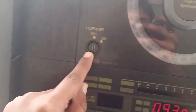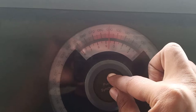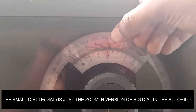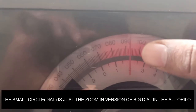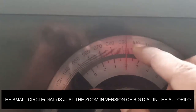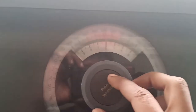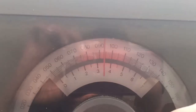To synchronize, you can use your nail or a coin to turn the switch off, then push the button inside and move it as needed. Moving anti-clockwise, you can see the dial is moving. One important thing: it is hard to read the fine precision of the numbering inside, so use the outer ring for reference — for example, 92 outside matches 092 inside. We need to go to 94 as shown on the gyro heading, moving the inner circle to 93 and then 94.